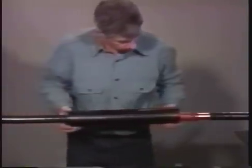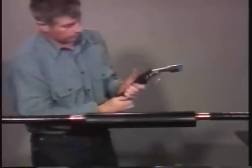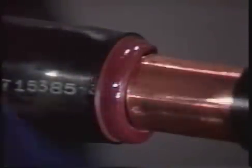When installing multiple layers of tubing, make sure that the surface of the last tube is still warm before positioning and shrinking the next tube. The next layer is the co-extruded black and red tube. The interior red portion is insulating material and the black outer surface is semi-con material. Position it over the red insulating tube and shrink as illustrated before. It will take longer than the previous layers to shrink because of its heavier wall. When the shrinking is complete, the adhesive should flow onto the cable semi-con, sealing this layer.